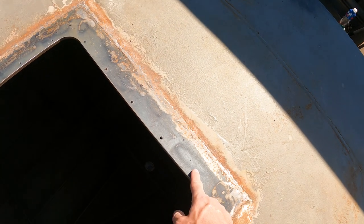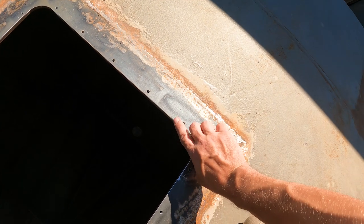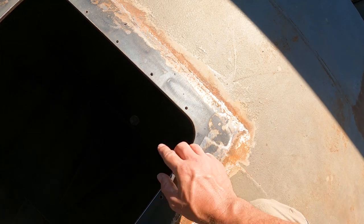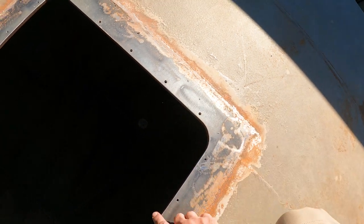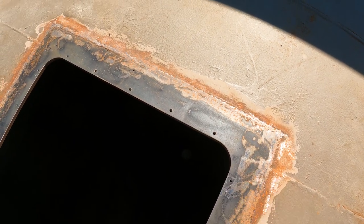Before painting, you've got to make sure you have a decent chamfer on the inside and outside of the holes, and also put a 45 on this edge here, just sort of round it off. You can't paint over a surface with a knife sharp edge. As the paint dries, it actually pulls away from this corner and you'll end up having a corrosive corner, and that'll just lead to delamination of the paint.